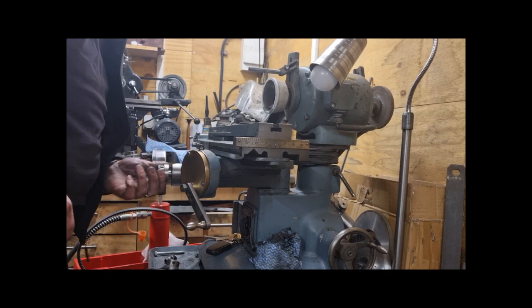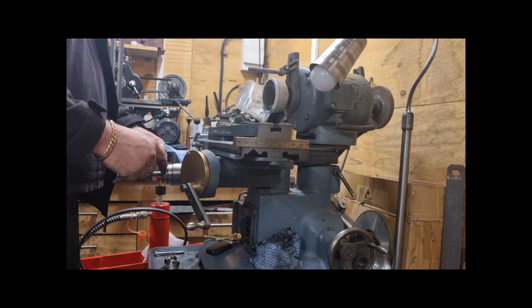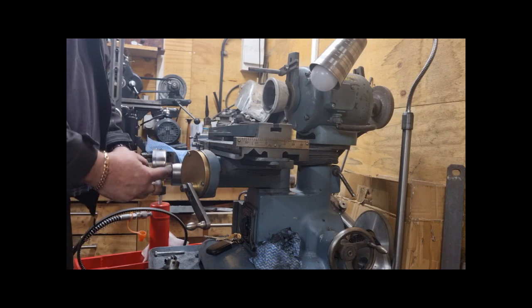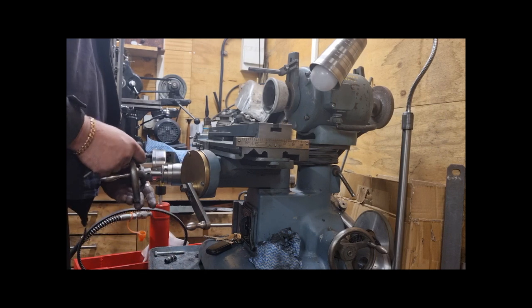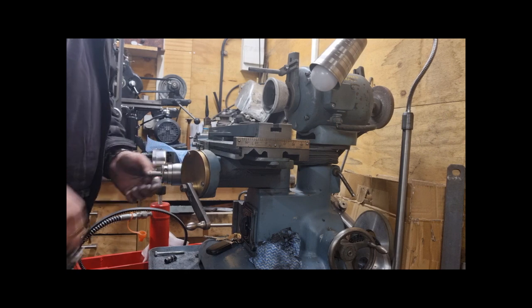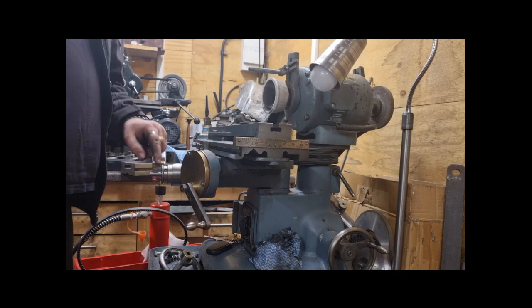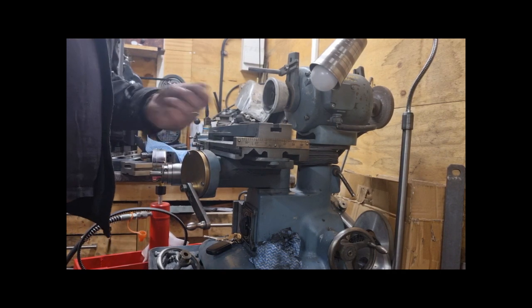In fact, you know the crack anyway, you know how to put this on. 2 set screws there, so it needs 2 brass plugs putting in before you tighten it down on this section here. And then the handle will go on. Then the grub screw will tighten down onto the flat. And then that'll be the job done. Once I get that sorted, thin down a little bit, I'll come back to you and show it in motion.